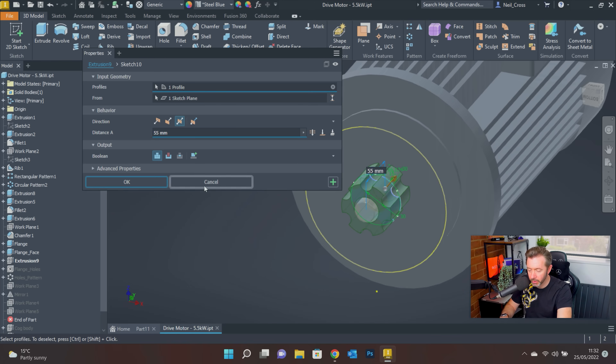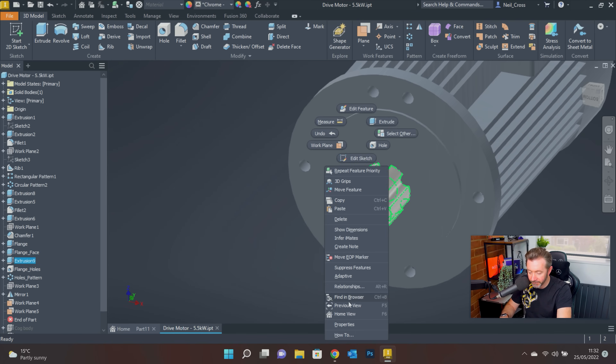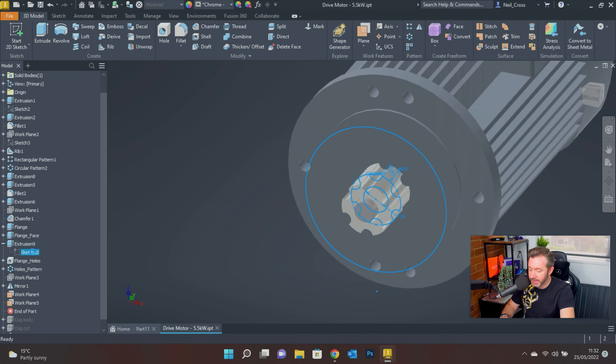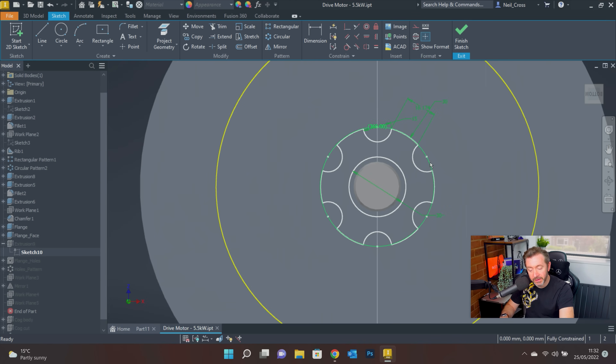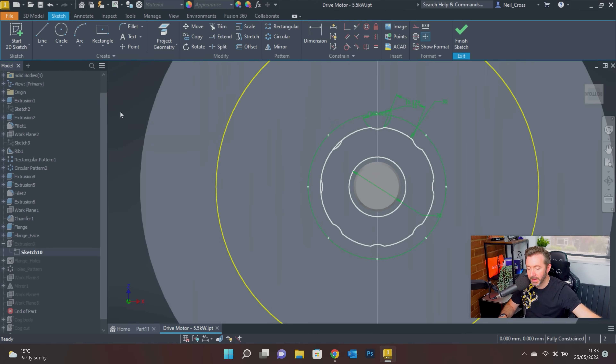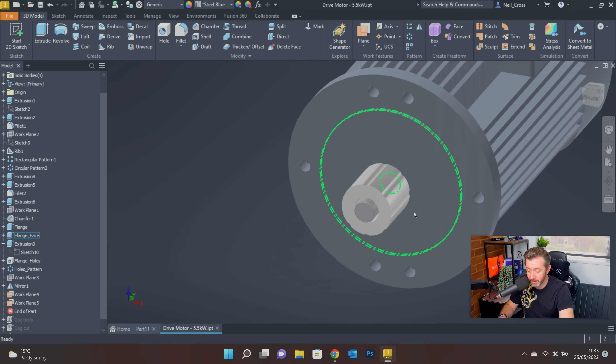You then have to spend a couple of seconds getting your head around why it's done like this — it's all one extrusion, that means it's all one sketch. So you'd have to go back in, right-click, find it in the browser — there it is, sketch 10. Finally got there. Hopefully the sketch has been done properly. It worked when the guy originally did it with the original design intent, but now the client has said we need eight cuts on the cog instead of six. So we've got to change this pattern to a pattern of eight. And the sketch pattern has just gone all cock. Why do I have to deal with somebody else's messy sketch? I've got to edit the dimensions, reconstrain it, and that's about two minutes of time I've got to put into fixing this sketch.